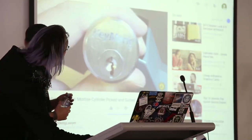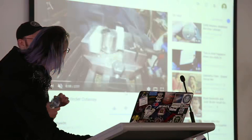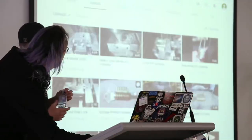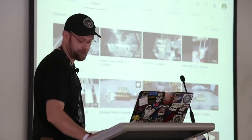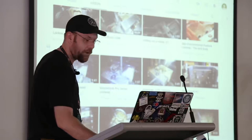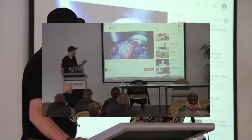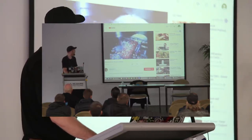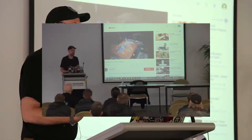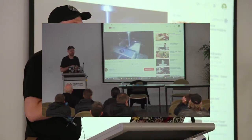That was a really fun lock to pick. Keymarks have a really crazy keyway — they're really hard to get in North America. Here's the Master Lock Pro Series — a re-cuttable lock by Master Lock. These locks are such a pain because there's something they put in the metal that dulls your end mills really quick and gums them up. I do them on request, but that's about it. It isn't like a Lockwood that I would — I love cutting Lockwoods. They're a joy to work with; the tolerances are nice and tight in them.